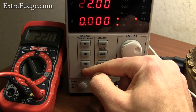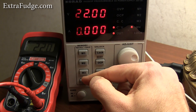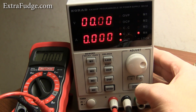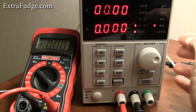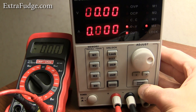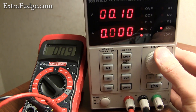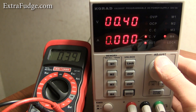The memory buttons, however, if you accidentally bump them, you don't want them to fry your circuitry — so I think it's a good precautionary safety feature. I'm going to change the voltage all the way down to zero, and at zero this one actually shows zero. Let me move the range a little less — zero is zero. I'm going to move it to one decimal place to change the voltage and we'll see how it adjusts. I'm not going to speak out the voltages, but you can see both of them on the screen and judge the accuracy for yourself.